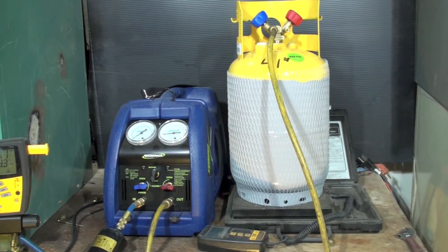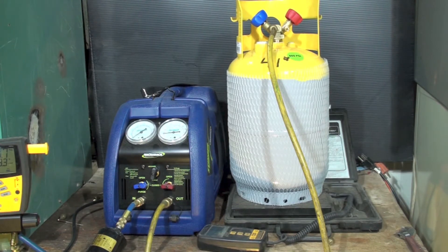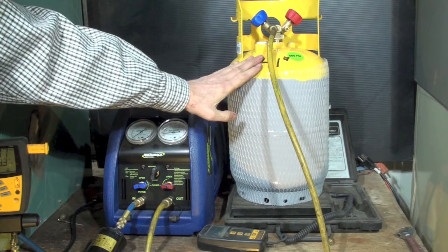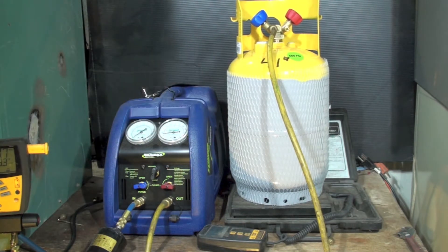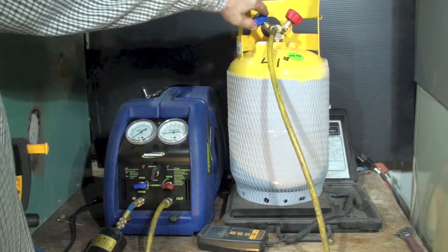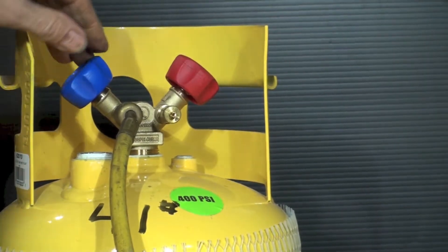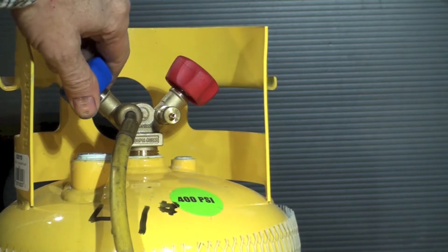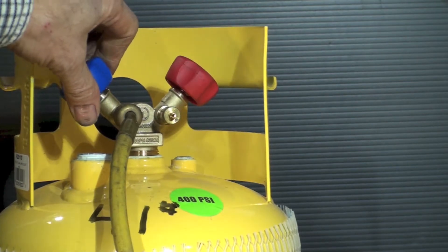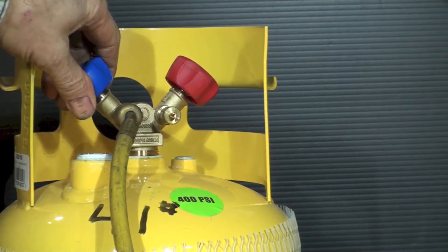On this one I just wanted to go over a couple of things I do for maintenance and storage of this equipment. The recovery cylinder — there's not a lot to do. However, one thing with these valves: I've seen an awful lot of these handles broken off. The reason they're broken off is everybody's tightening these things down really tight. Don't get crazy on tightening these down — it's not that huge of a deal. Get them snug; they should hold fine.